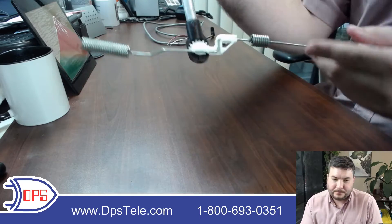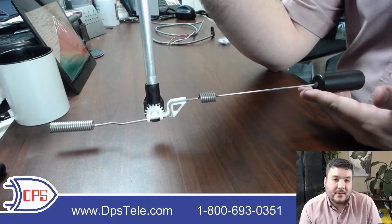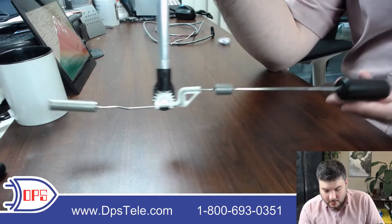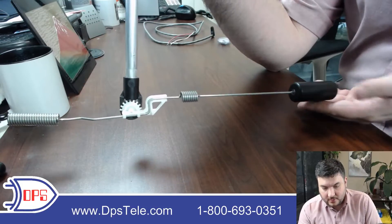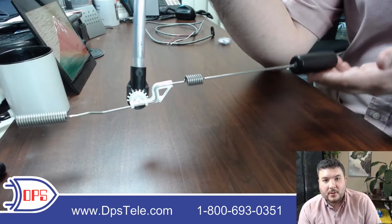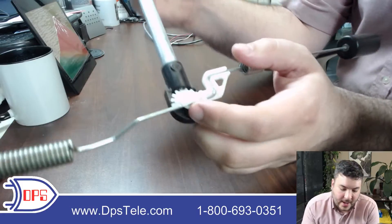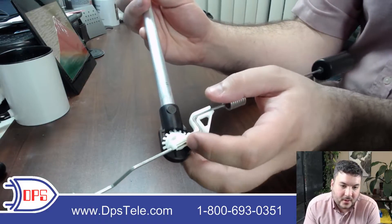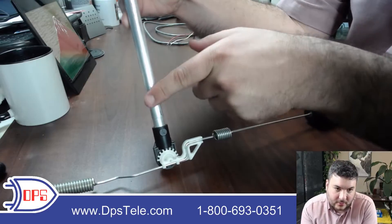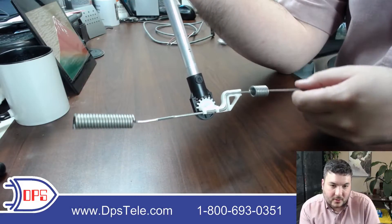We'll start with this float. This is a very common design and your propane tank probably has something like this in it already — and that's great because ideally we're going to be able to keep using it. The black float goes up and down with the rise and fall of your liquid level inside the tank. That causes this white gear to rotate, and when that happens it's engaged with a perpendicular gear with black teeth, which is connected to a shaft that runs up this silver cylinder, actually rotating inside as I turn the float gear up and down.